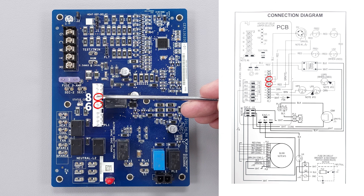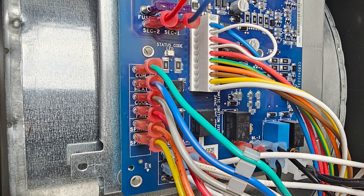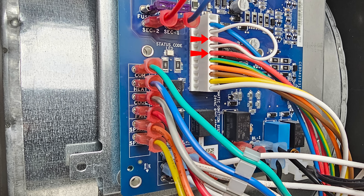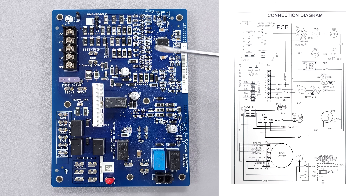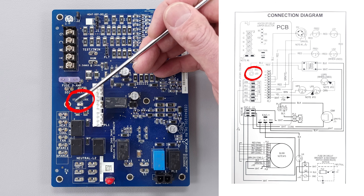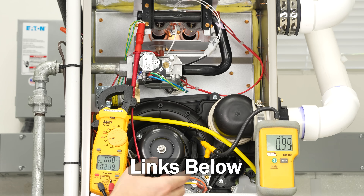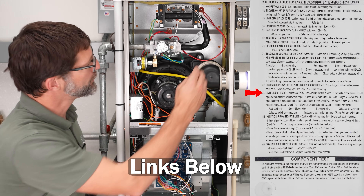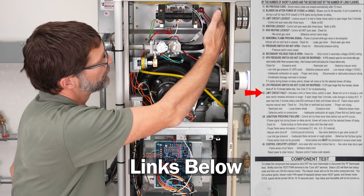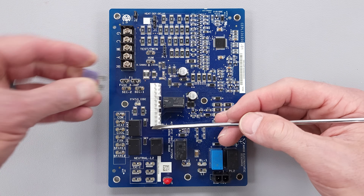Right here at pins 6 and 8 - one of these is going to be applying 24-volt power from here, going through the switches and then coming back on either pin 6 or 8. If one of those switches is open then the circuit board knows we have a problem. It's going to flash an error code at the status code LED - we have a whole other video on determining status code lights for Carrier, Bryant, and Payne furnaces. It's also going to turn the fan motor on to try to cool off the heat exchanger if the high temperature limit switch is open.